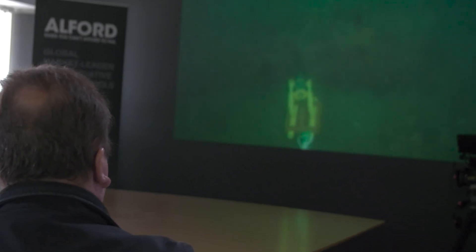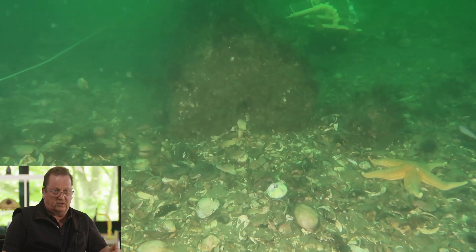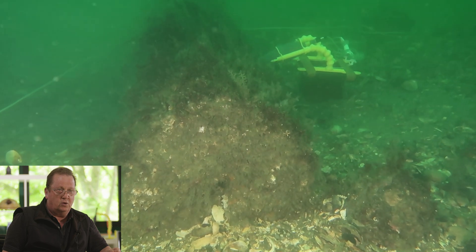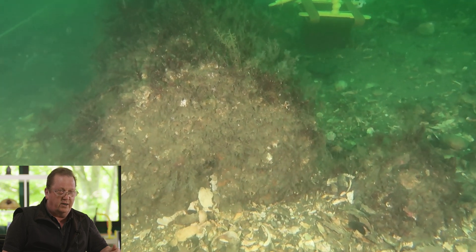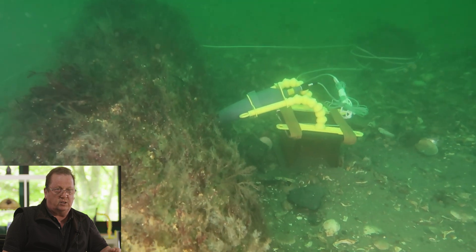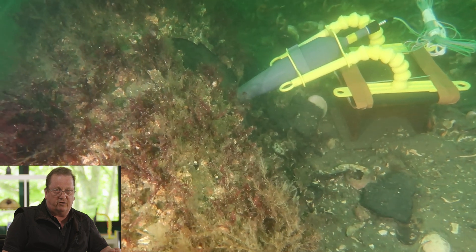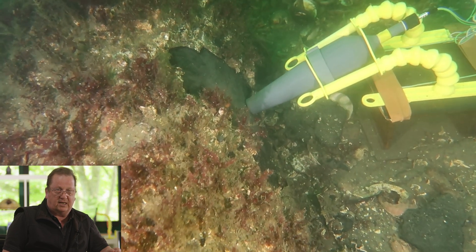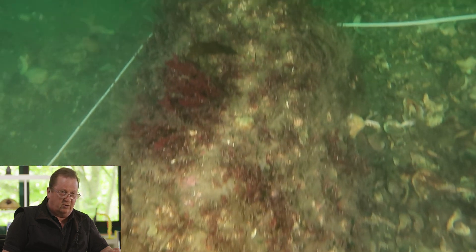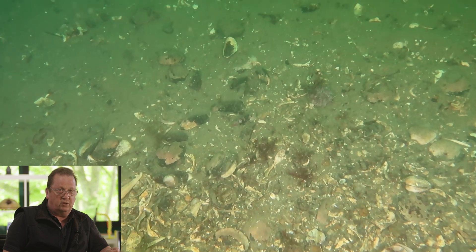This is a diver video of an underwater deflagration technique, showing the setup. You can see the end of a World War Two British ground mine, and the shaped charge set up — a 65 millimeter shaped charge, 250 gram explosive, an air standoff capsule, and a low-density incendiary fitted. The diver has wrapped his firing cable around the mine to stop it dragging.